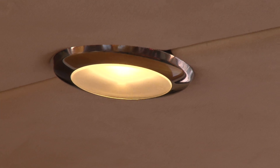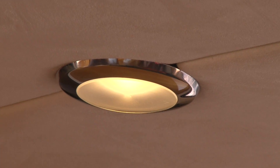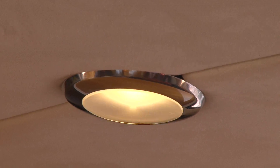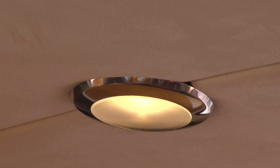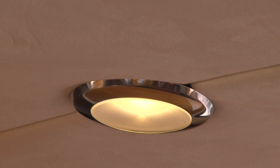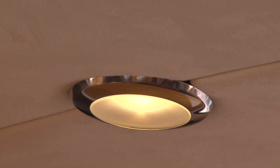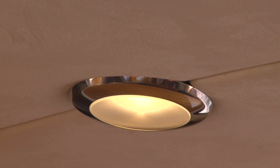At the lower level there's a little flutter — you can see the light flashing or strobing with these older dimmers. That's to be expected, but fortunately we've designed these lights to work extremely well. We've tuned them to work perfectly with our own interval switch mode dimmer, so we'll just change these dimmers out with the switch mode and they'll be fine.